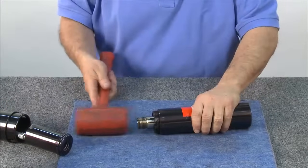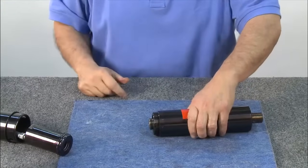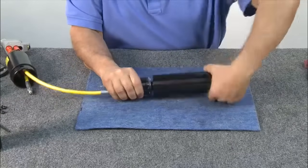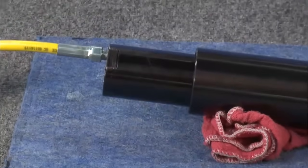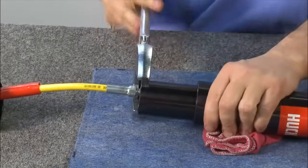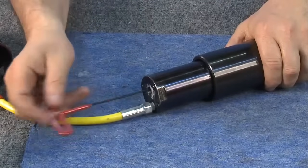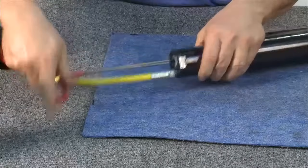Next, we'll install the rear piston. To make installation easier, first move the rear piston to the back position. Turn it around. Apply grease to the rear piston and inner and outer seals. Turn the cylinder until the rear piston seal bottoms out. Use a rag to help position the tool. Next, use the wrench to tighten the rear piston to the front piston. Then back out the rear piston to line up the ports. Use a long rod to check and make sure ports are lined up. Once ports are lined up, install a hollow cap screw into the port to lock the rear piston in place.